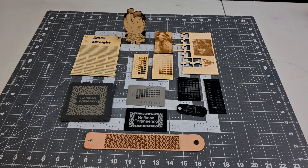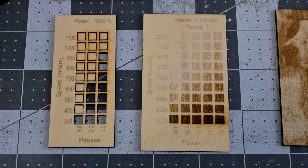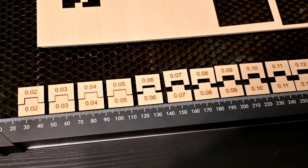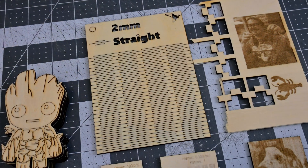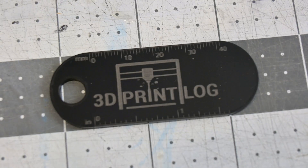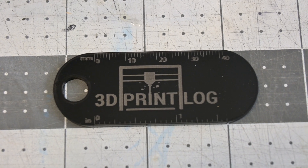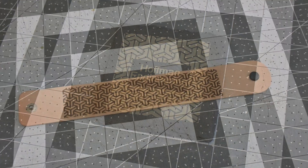Wood is the bread and butter of diode lasers, and it was easy to dial in settings for cutting and engraving. With Air Assist, I was cutting 3mm plywood at 350mm per minute, making the DIY Kit Mark II one of the fastest cutting 10-watt lasers that I've tested. The laser is also very well-focused — my kerf tests showed a kerf offset of only 0.05mm. That very small laser dot helps with cutting and engraving accuracy. This picture of my dog Jack looks great. This living hinge, cut directly off of an SVG on the SD card, turned out great — very accurate cuts with very little darkening around the edges. While diode lasers cannot cut clear acrylic, it works very well on opaque acrylics. This 3D print log keychain has a beautiful high-contrast white engraving and cut very cleanly. I was cutting 3mm black acrylic at 300mm per minute in two passes. I'm also a big fan of slate coasters, and the DIY Kit Mark II did an excellent job engraving them. The DIY Kit Mark II also handled leather perfectly — with Air Assist, this pattern engraved cleanly with no darkening around the edges.